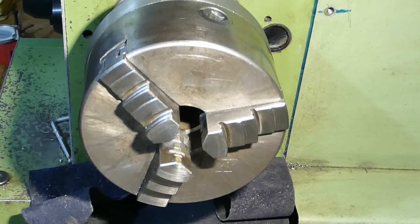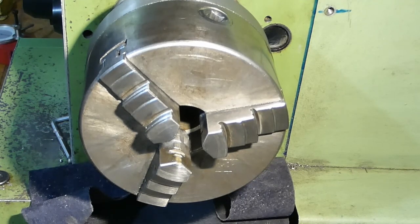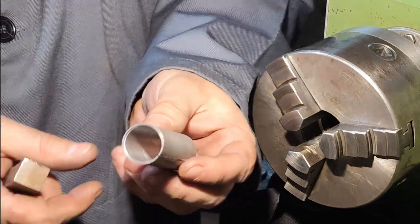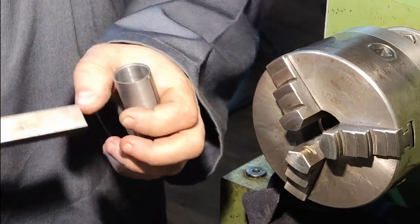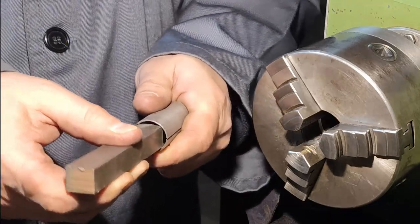So we are now in the process of making our special boring bar for the internal thread that I need. It is an opportunity to show a trick how to hold square stock in a three-jaw chuck. I believe most people are familiar with that, but nevertheless, while we are here, we can talk a little about it. So the trick is in the bushing. We make this bushing so that our square stock fits inside